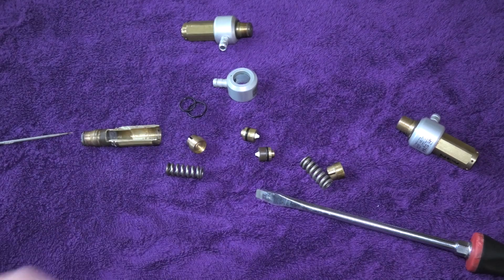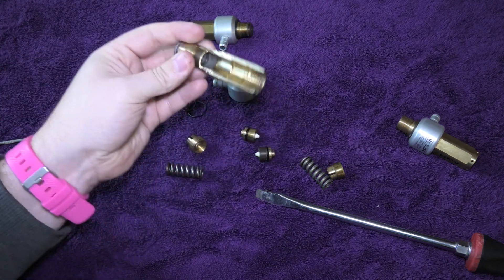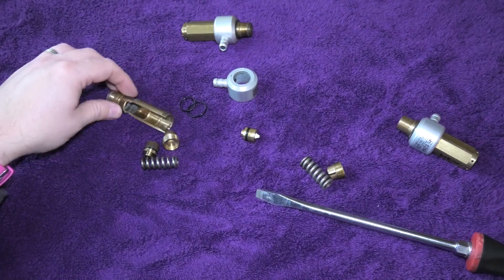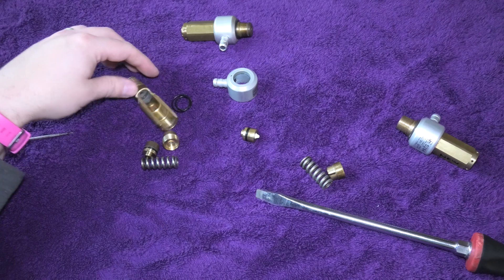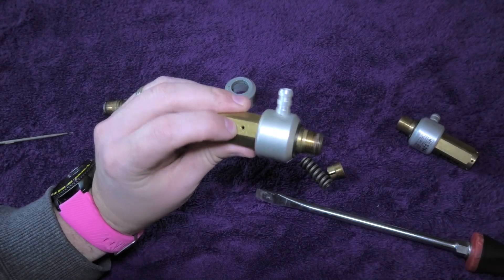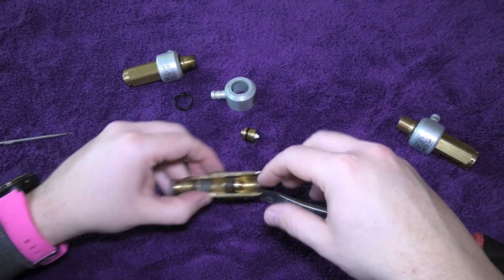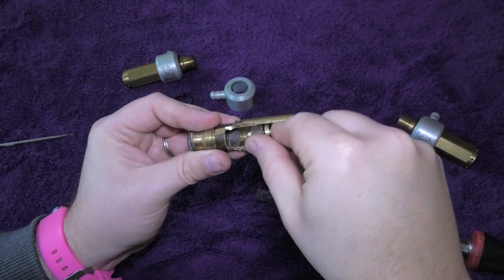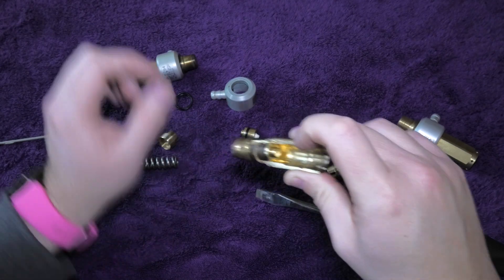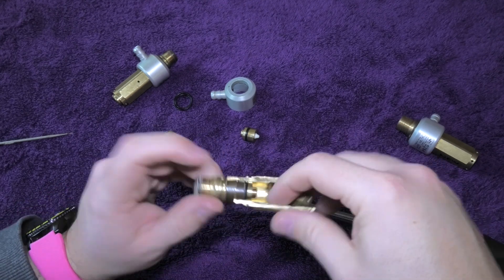I'm no specialist on these — I'm quite happy to take something apart. They're very, very basic. If you are having issues, you can't buy replacement parts for these; they're all one unit. You may be able to chuck new o-rings in. The only other thing these have — which you'll see on the one that hasn't been cut open — is a small little hole there. All that hole does is, because this chamber is technically sealed, if the seals start to perish and it's letting water by, it will basically come out of that hole. So as long as that hole is clear, you know the seals on these are good — although that doesn't mean to say that the ceramic tip is any good.